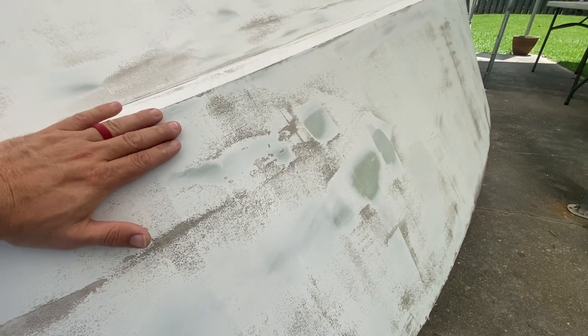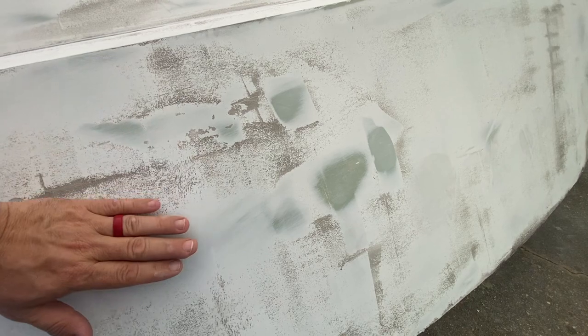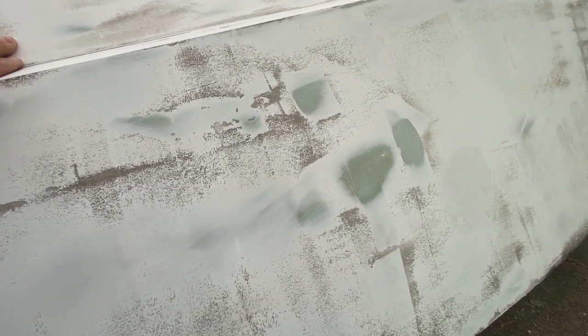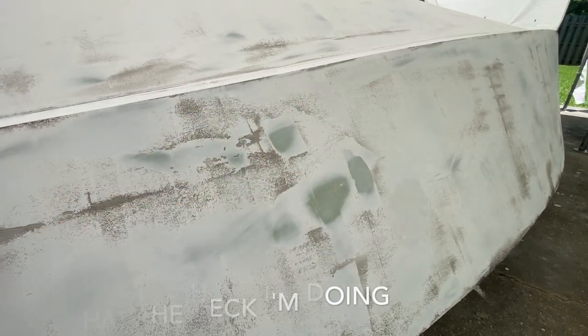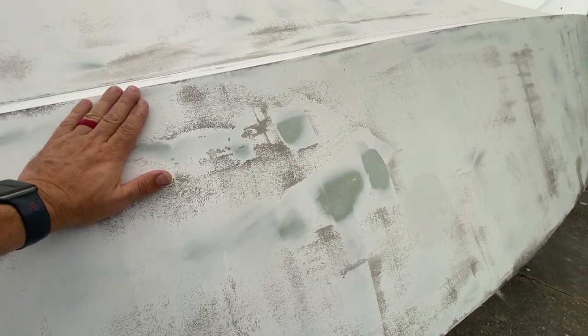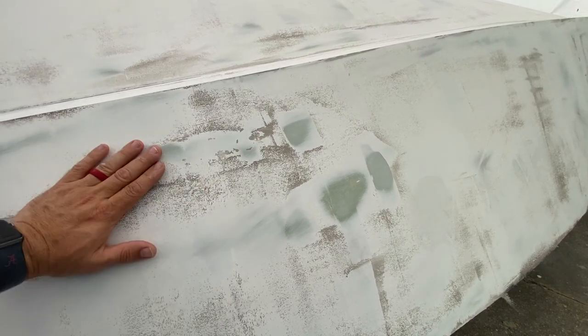Especially where you can see multicolors in here, when you're trying to make this thing wholly smooth and fair, these colors just show where I had some major issues. Now the plan at this point would be that once I fill this with fairing, so it's going to go back to green, I'm going to sand that back flush to all of this. And now that I'm using 120 grit sandpaper, I'm not cutting as much.